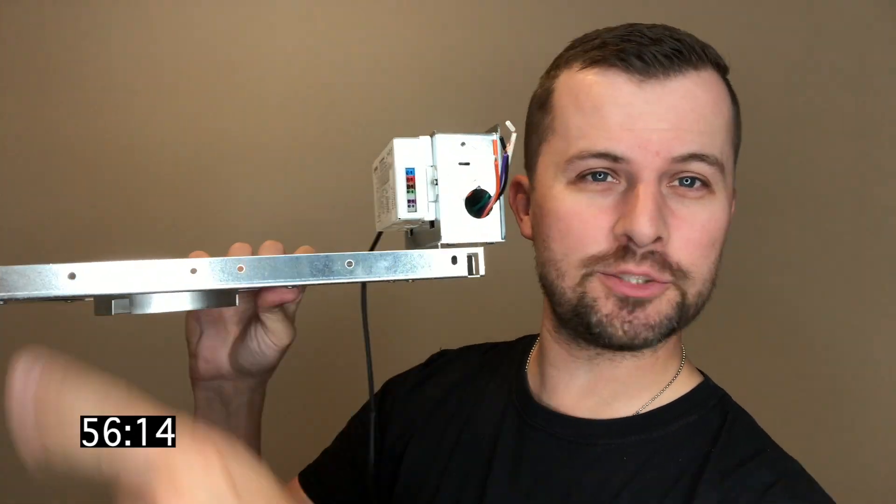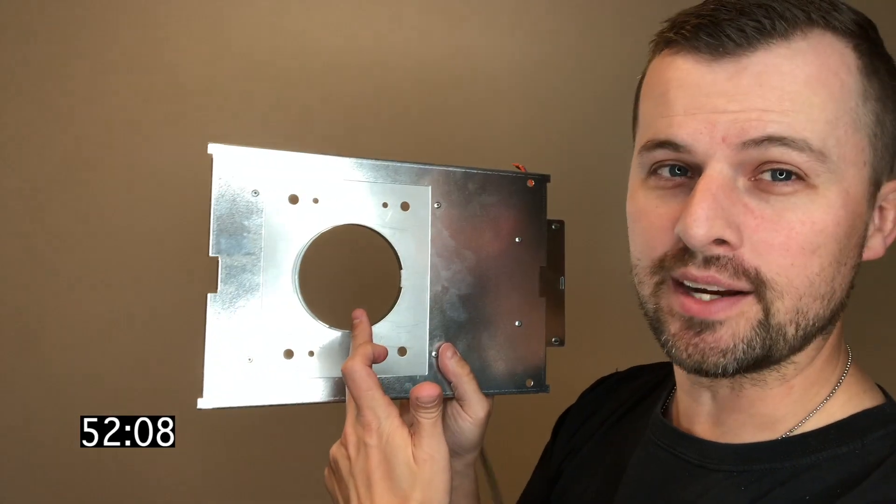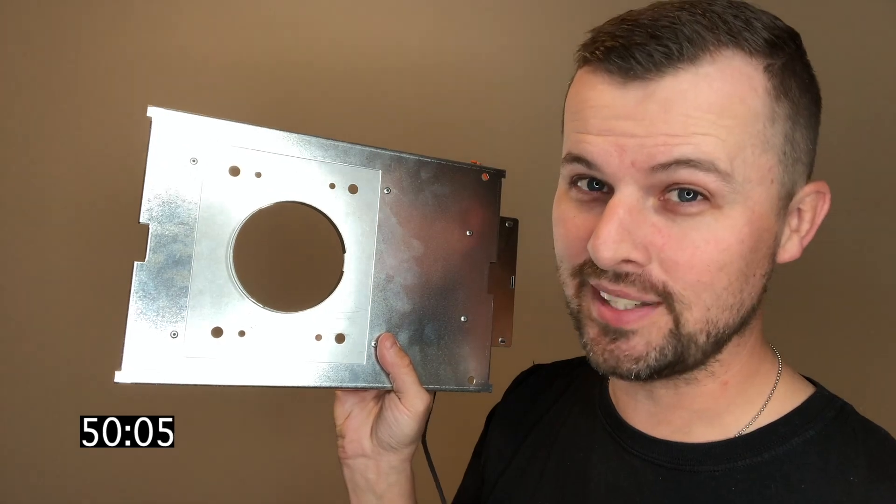You have the bottom panel that sits flush with the ceiling, and we have the electrical component here that holds our driver in place. The key being this aperture cutout. This is cut for my DL33. Remember last week? What is a DL33 RF70? That's a 3.3 inch round 70 millimeter aperture downlight — not a 057 ABCDEFG, the Batman Symbol 567, like some of our competitors.